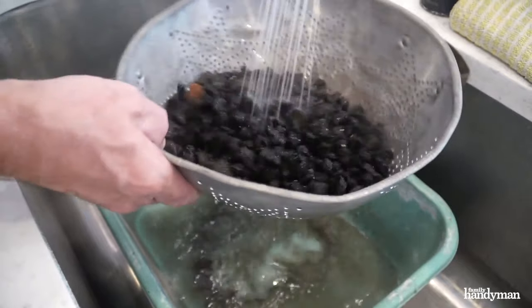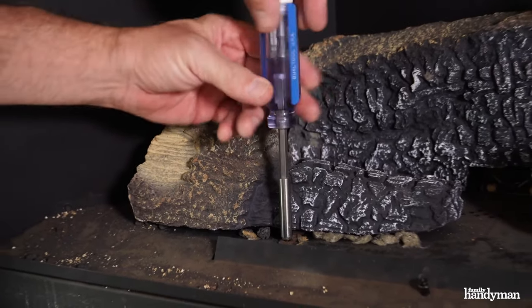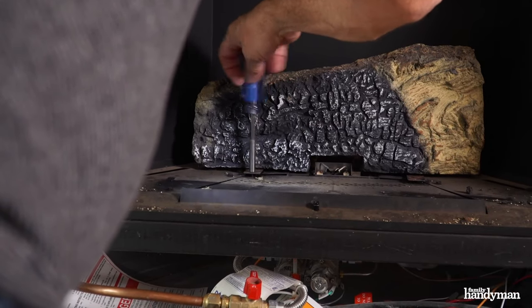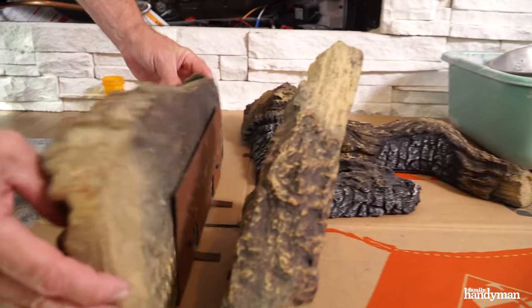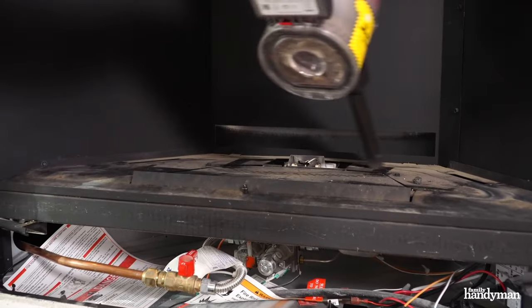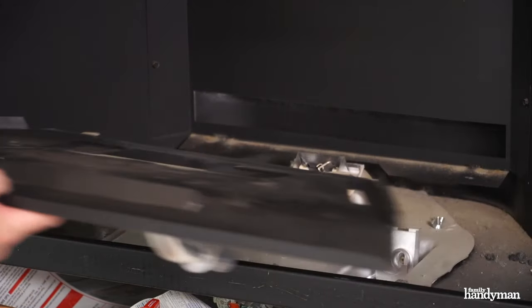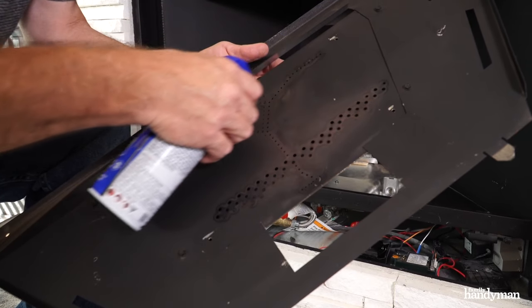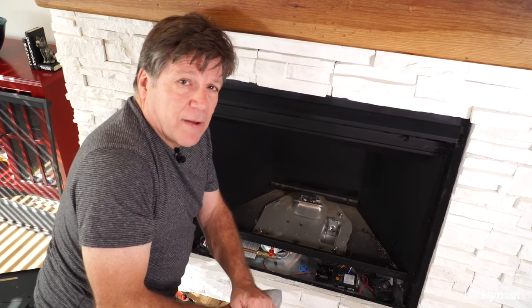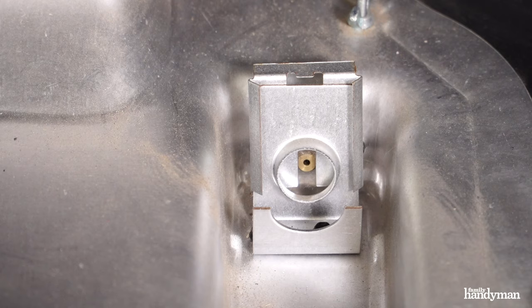Rinse the lava rock with water and put them on a towel to dry. Sometimes you'll find you'll need a screwdriver to remove the logs. I blow the dust off the logs with canned air and vacuum out the firebox. Just like the logs, I clean out the burner with forced air too. Now that I have the burner cover off, I'm going to continue to clean out the compartment, inspect the pilot light, and the burner.